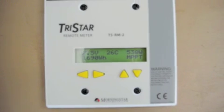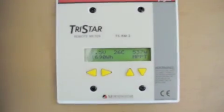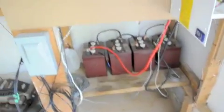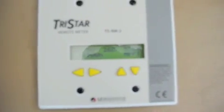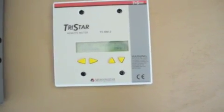That's pretty good. My system's 750 watts so it's getting there — it'll peak in about an hour. The thing about these TriStar meters I didn't know: once your batteries are full, they'll actually stop bringing in power. I came out here the other day, batteries were 100% full, and it was only bringing in 100 watts. The MorningStar charge controller knows if your battery is full, so it just says it's not bringing in any more power, and that's that.